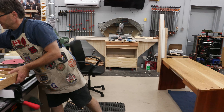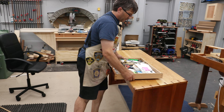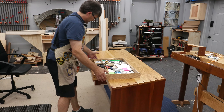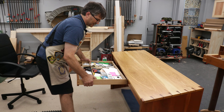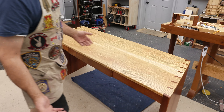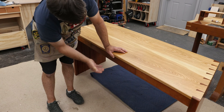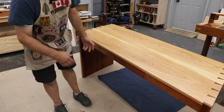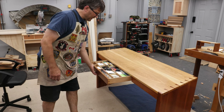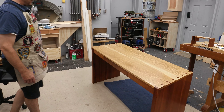The drawer, aside from being full of junk, has traditional through dovetails in the back and through dovetails in the front — maybe not so traditional, but I wanted to continue the theme of exposed joinery. If you dovetail a drawer, it's going to be around for a long time — it'll outlast the piece it's fitting in. My severe disappointment, other than ending up with these splits which there's no way to fix, is that somewhere along the way I didn't get the drawer fit the way I wanted. There's some side-to-side slop that I don't normally tolerate in my work. That's unacceptable and I would never sell a piece of furniture like that — maybe that's why I kept it.